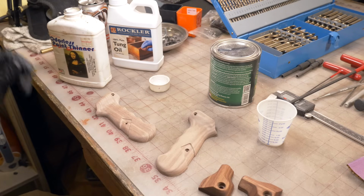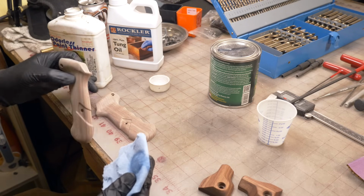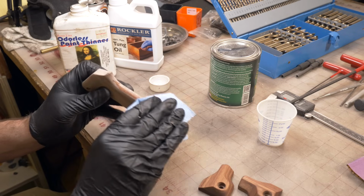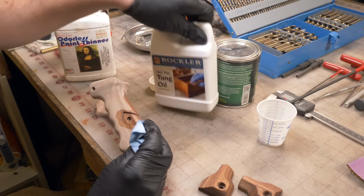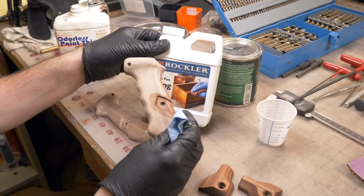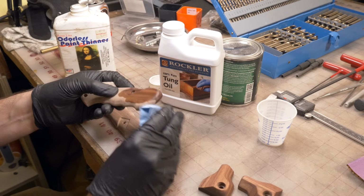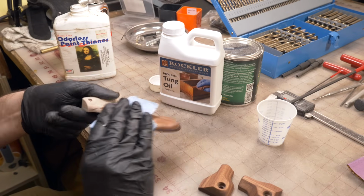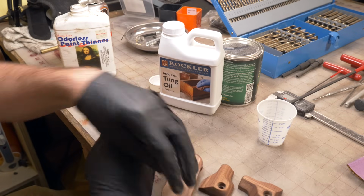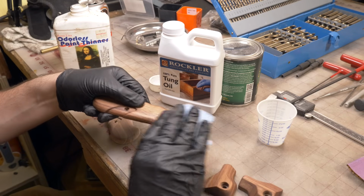Got everything sanded to a 200 grit, pretty happy with it. Now I'm just cleaning everything off with mineral spirits to prepare it for the finish. And this is what we're going with. Not sponsored or anything, but I went to the Rockler near my house and got some good advice on the finish. I'm gonna use this tung oil. Hopefully it gives it just a little color, makes it look a little more red as per our reference.